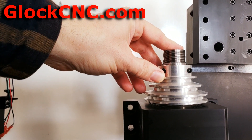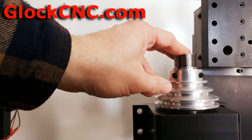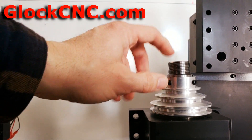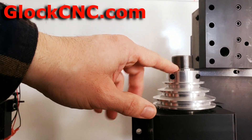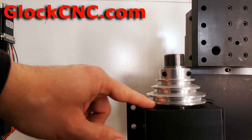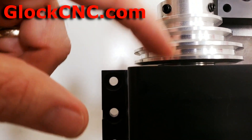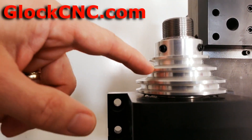It's a three-step pulley. For 99.9% of applications it won't be needed, but you can also put a jam nut in here to compress the pulley against the bearing. There's actually a boss — you can't see it in this video, well maybe you can — right down there, there's a boss that pushes against the inside race of the bearings.